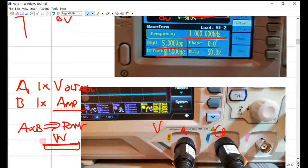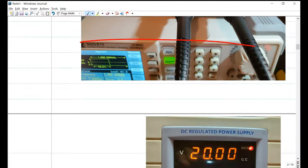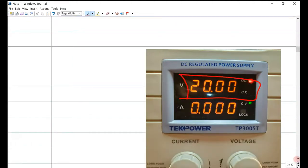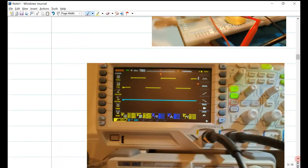We're using 20 volts as the DC power supply value. The best setup is to put your oscilloscope on top of your function generator. There is a gate terminal — this is the input from the function generator, the square wave controlling the oscillating frequency, the open and close frequency. Channel A is voltage in yellow and Channel B is current in blue.